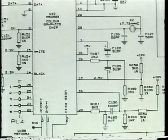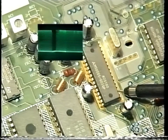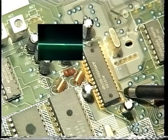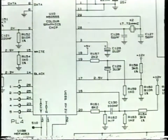Connect your oscilloscope to pin 19 without the LNB connected. Observe the waveform. This signal is amplitude 2. If you look at a TV monitor, you will see a coloured raster. Now connect the LNB and see the signal disappear as the video information is received. And again with the LNB disconnected.